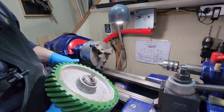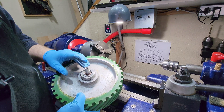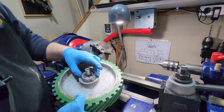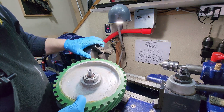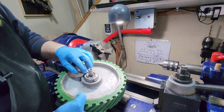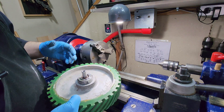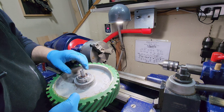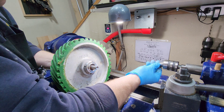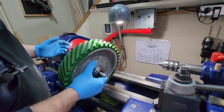My plan for how I'm going to true this up and hold it in the lathe is: it has this nut on the back that has been machined down, and I'm going to put that in the three-jaw chuck and clamp onto it. The three-jaw chuck arbor is too big to fit inside this hole, so the next best option is to clamp onto this machined surface. This will reduce runout as much as possible. Then I'll have the shaft sticking out and my live center going into this hole here to help push it in and support it.